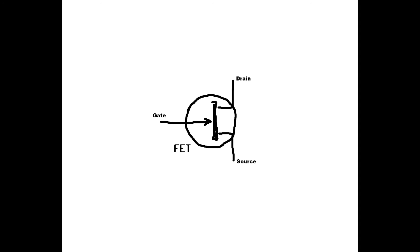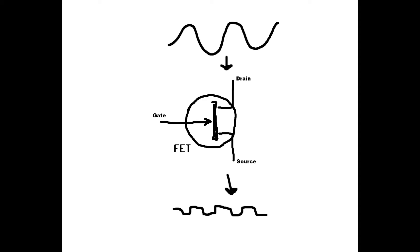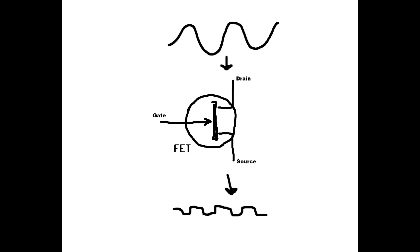Saturation mode is analogous to how we would think of this term in regards to audio signals, where large relative changes in input signal become only small relative changes in the output signal. These two concepts are so related that if we were to build a basic FET circuit and pass audio through it while operating the FET mostly in the saturation region, we would essentially have a very basic solid-state guitar preamplifier circuit. In the guitar preamp example, the FET is reacting nearly instantaneously to the signal — the volume changes happen so quickly that we perceive the side effect of added harmonic content more prominently than the volume changes themselves. When we use a FET in a compressor design, it's still doing the exact same thing, except we apply a timing circuit that slows down and smooths out the response of the control signal, reducing waveform distortion and added harmonics so the volume changes become the most prominent aspect.